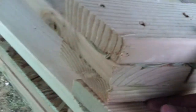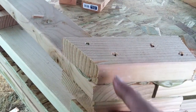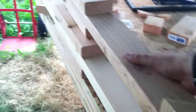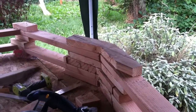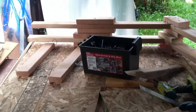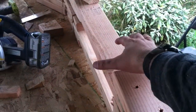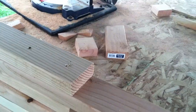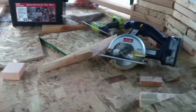Over here I'm also sandwiching it, gluing and nailing or gluing and screwing — a lot of glue in there to make up for any gaps. That reinforces the trusses with a lot of wood and also gives me a lot to nail to when I sheathe the roof. This will eventually get probably an Enduro roof. This is how I'm making the trusses without having a cross beam going straight across that kills the headroom in the loft. The trade-off is you've got to really reinforce the corners, and I'll be running some reinforcements — basically spacer blocks for the horizontal reinforcements.